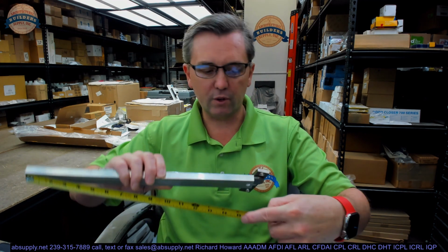So this is a 136 is this part number. 680J is the series, but it's a 136. It's a pretty unusual one in the sense that it's for a narrow door. Now, this could be very typical and common for interior low or medium duty volume, but you wouldn't see a 680J on a high-use exterior door. It's not a heavy-duty unit.